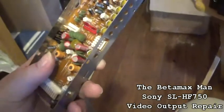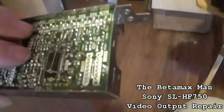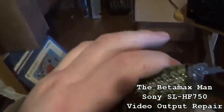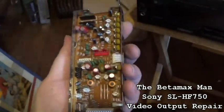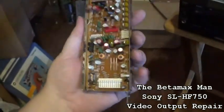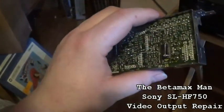So with the broken leads on the capacitor, and actually that one is shaking, moving around, so I'm gonna fix that, put it together, and then we're gonna see if we got a picture, because I'm pretty sure that this is all that's wrong, and this should get our issues back up and going. Should be able to get this amp to work properly.